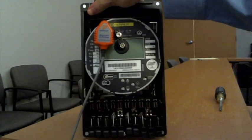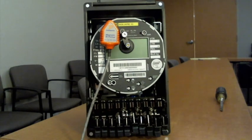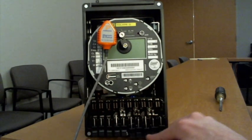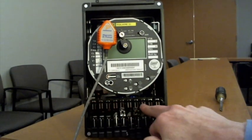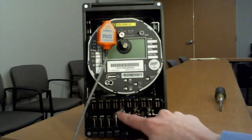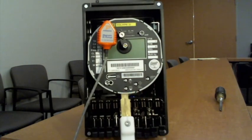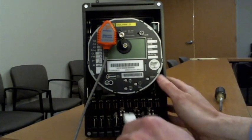I was seeing that Martin was talking in the chat area about the cases where they do get an integrated test switch, you can actually isolate here. So this is integrated into the side. My voltages are isolated here, and then I've got my currents. And notice that these are very, very small duckbill style probes. The probes that John showed won't work. So you're going to need something like the smaller style, which is what we call substation style test switches. And those actually insert into these integrated switches like this.